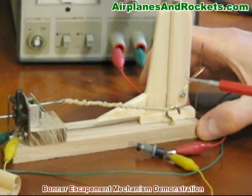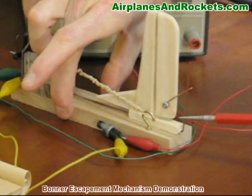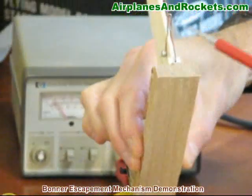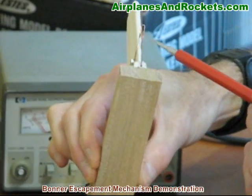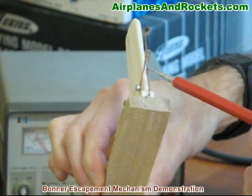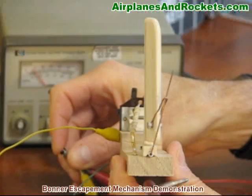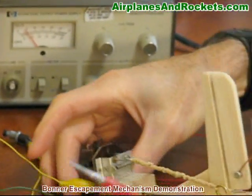In this case, for this mocked-up rudder, it has bent up in the back, and then it is run through what we would call a control horn for the surface nowadays — just a slotted piece of metal that runs around this torque rod. As the torque rod moves back and forth, you'll see how it controls the surface itself — in this case, a simulated rudder.